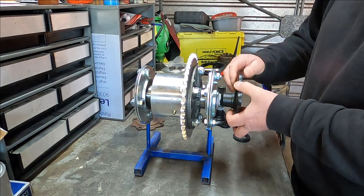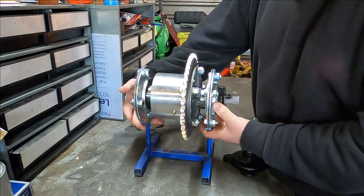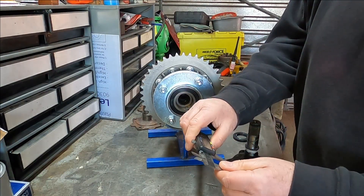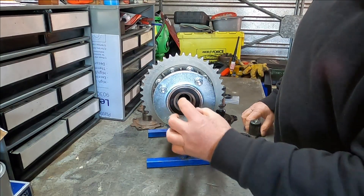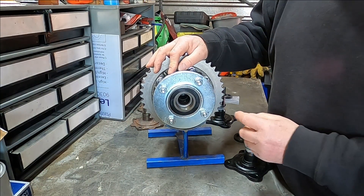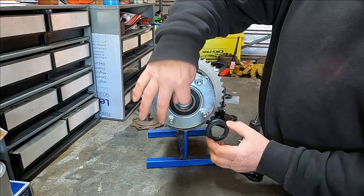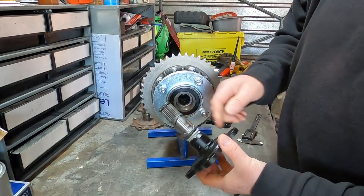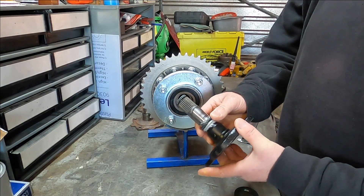What I'll do is make up an extended housing that pushes into the bearing. In here there's a recess about 14 or 15mm deep, so there's plenty of space for me to push in a carrier. Rather than machining a carrier, I'm going to do a 3D printed seal carrier. The seal will sit out about here and the housing will push inside. On the original version I just glued on a dust seal to stop any muck getting inside, but that wouldn't keep any lubricant from coming out.